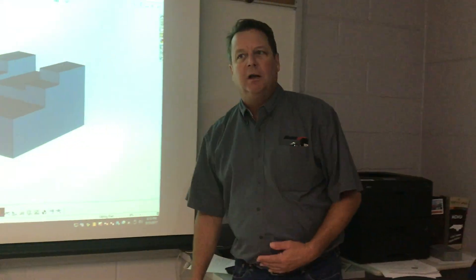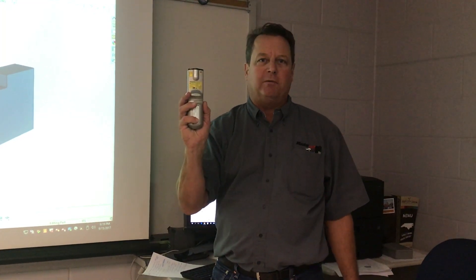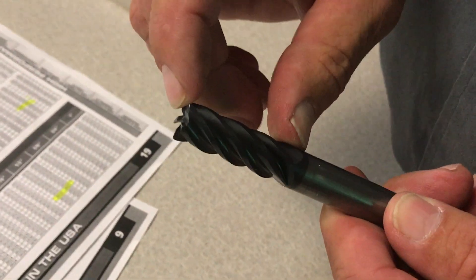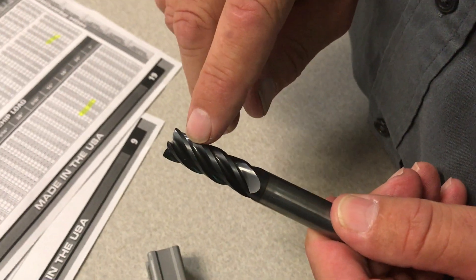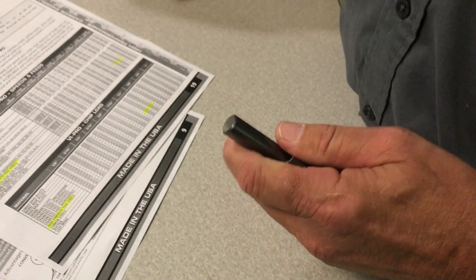You don't do dynamic machining unless you have the right tools. Some tools are expensive — for instance, hydraulic chucks — but you must have an end mill designed for this type of cutting, which is characterized by great depth of cut with a small step over, fast RPMs, and fast feed rate called chip load. This is a VI Pro from Kodiak Tools. It is five flutes, has an inch and a half of flute length, is aluminum titanium nitride coated, and has a variable flute angle so the five flutes engage the part at different times and in different ways.